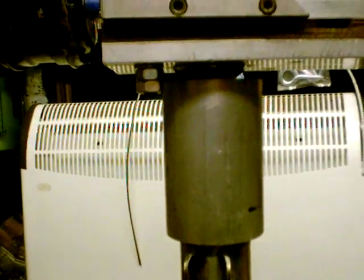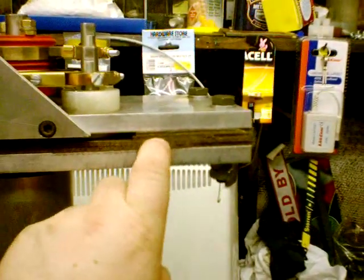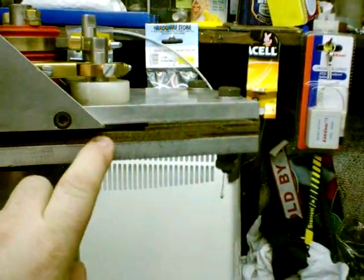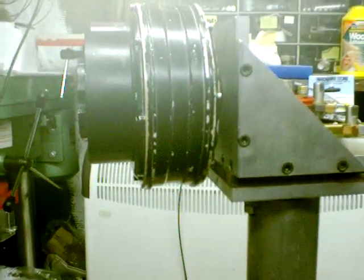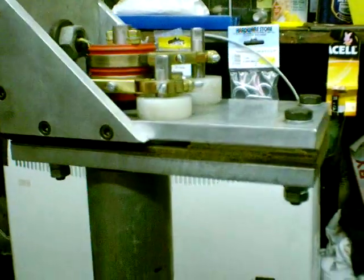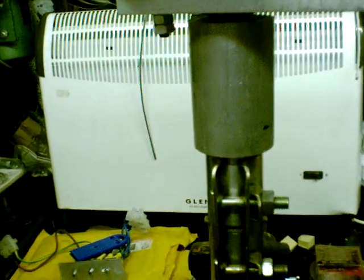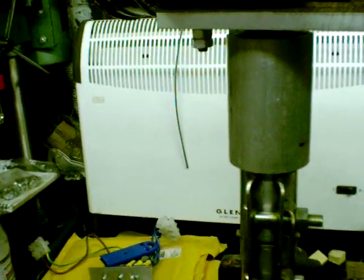The actual bottom half of it is made up of a piece of aluminium, machined out on a lathe. On the underside there's actually a shaft going through the centre which is bolted to the other piece of plate. The top bracket uses an insulating material between it to try and damp down some of the noise going through the generator, because the generator does make a little bit of vibration as the magnets pass the poles. I've made a top-hat assembly so it actually fits in a scaffolding clamp, straight on a 50mm scaffolding pole.